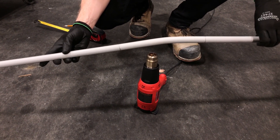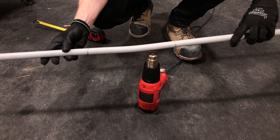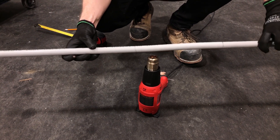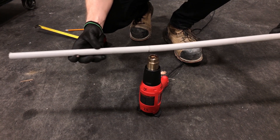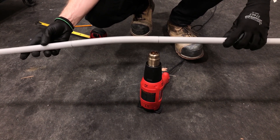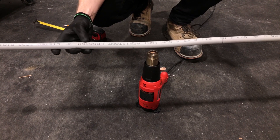The pipe will slowly start to get wobbly and a little droopy, and that's exactly the condition that we're aiming for. I'm going to keep rotating back and forth between my two lines, being very cautious to make sure that the heat has evenly reached everywhere between my two lines, including just outside the two lines, so that my bend takes place very evenly and doesn't cause a kink.